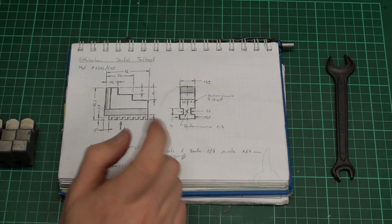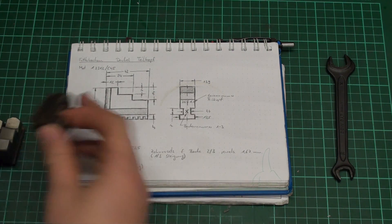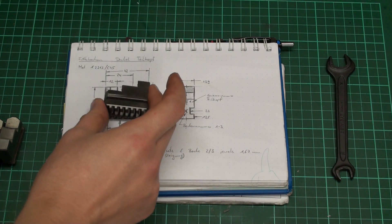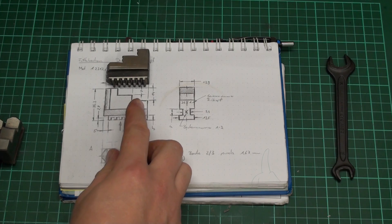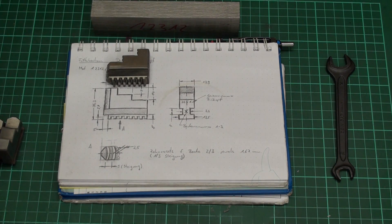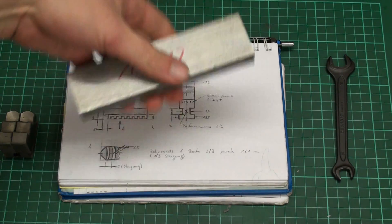This is what I came up with. These have the same outer dimension as the outside stepped jaws but are stepped in the other direction. I will machine them from this piece of tool steel — mold steel, pre-hardened to 33–35 Rockwell — it machines very nicely. So I'll use this so I don't have to heat treat them later.